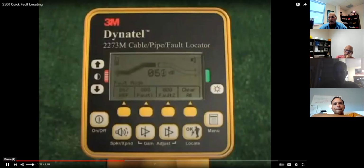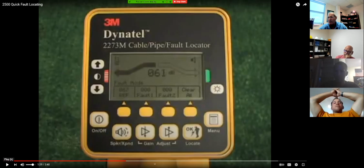Okay, pause it. You notice she's taking off some pretty big chunks, right? Yeah, go ahead. If you've got a lengthy span of cable out there, go ahead and walk it off a while. And then you'll start narrowing it down once you get a difference in direction.